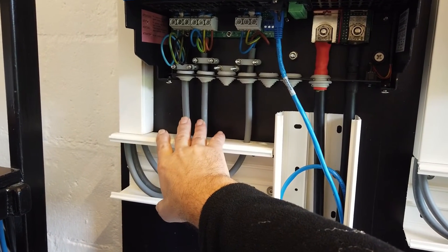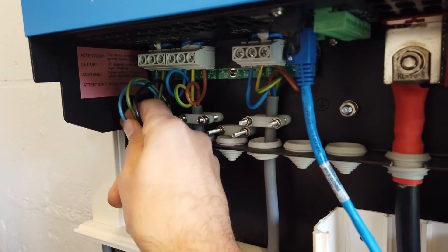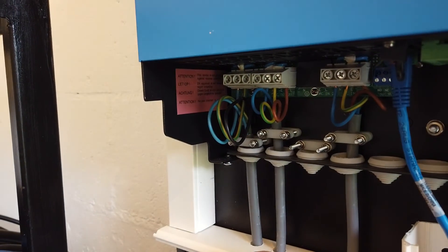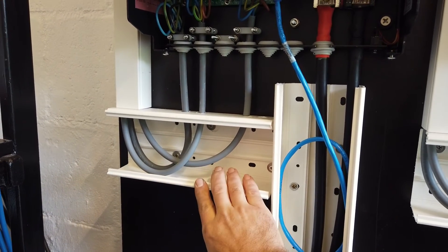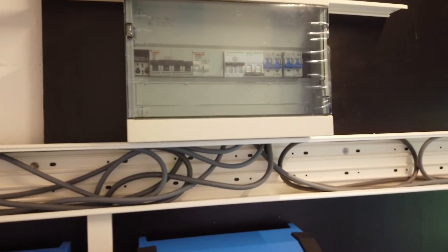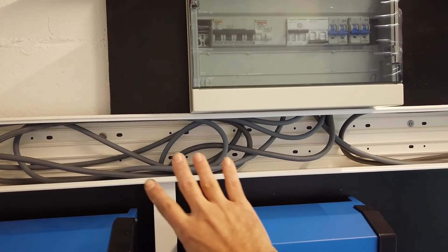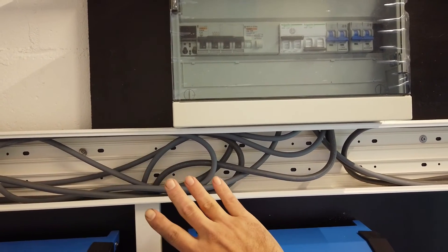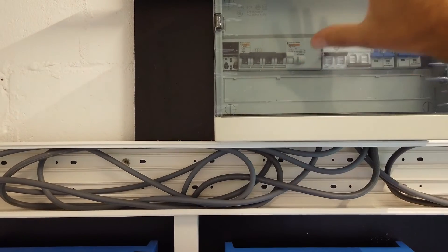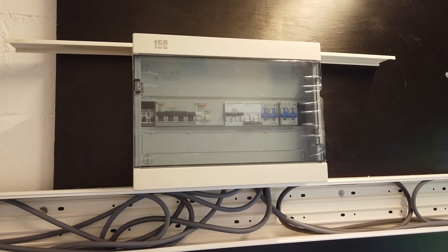Today it's only 2.5 square millimeter cable — I will upgrade this. If possible, always foresee a pigtail so you don't have any stress on the connector or the cable. Luckily I upgraded the cable gutters to a larger size — now it will easily cope with the larger 6 square millimeter cable. These cables go into a main breaker box. I always keep some kind of over-length; always foresee some extra length if you want to do an upgrade, so you don't have to install a whole new run of AC cable.